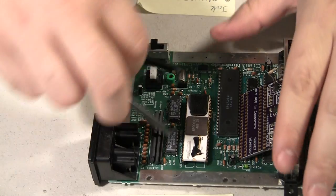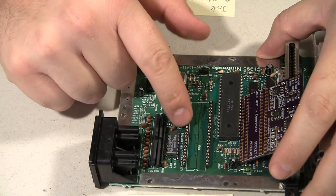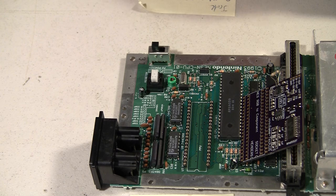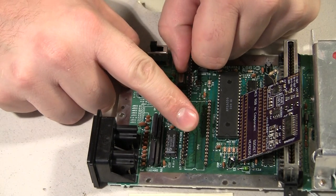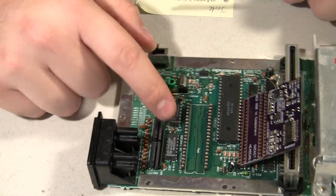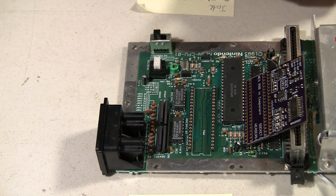Now one of the things is, once the RGB chip is out, I have these machine-turned inline sockets that I use on everything, and the headers that I have are these square type, and what I found is they will not mate up at all. They're too big for those holes, so I'm going to have to remove the old socket and replace it with a regular dual wipe socket, because these will actually go down in there and stay relatively well.